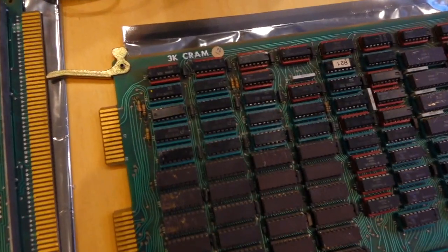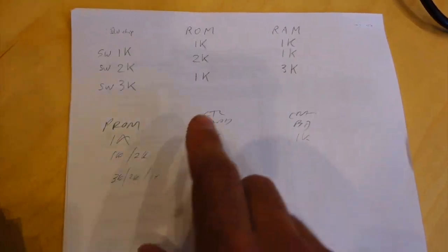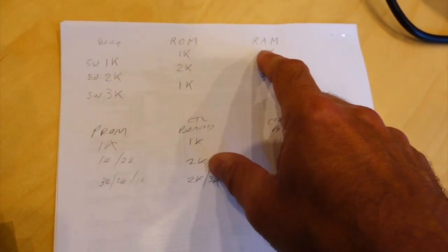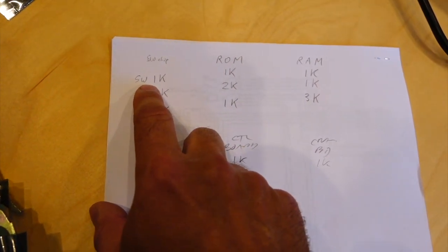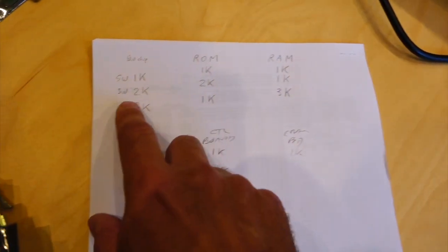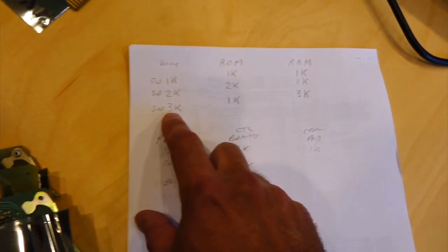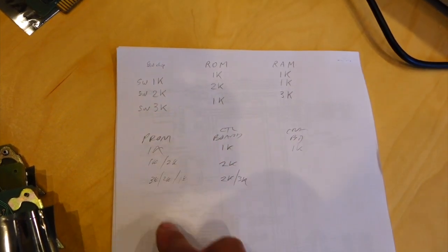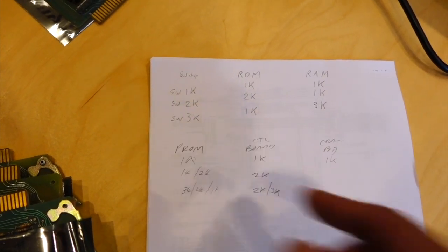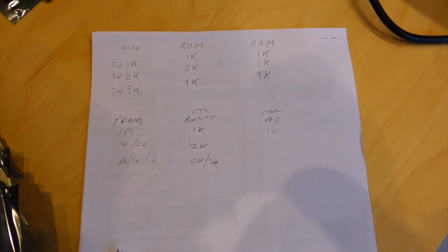Here's a 3K CRAM board — that would make our day. We're trying to jot down which are the available configurations. There are three described in the manuals: the original 1K ROM with 1K RAM that works with the SW1 decoder chip, and 2K ROM with 1K RAM that works with the SW2. It turns out you cannot just plug those ROMs into any board either, because they need a hardware rework. So there are not that many combinations that will work, and we definitely have one that is not legit.